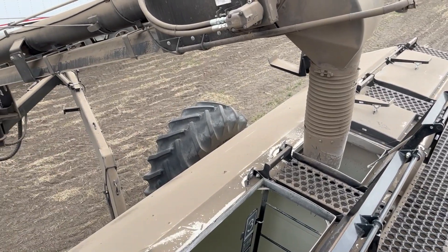There it goes. Sometimes it quits pumping because they're bottom-filled tanks — it takes a lot of pressure to fill the tanks once there gets to be a couple thousand gallons of water in there. So we might have to put another pump closer to the ditch, connect the pumps together along the same hose, and then that pump will push it into the tanks. We're kind of running out of options — not sure what we're going to do come in-crop or desiccating season. We're running out of places to get water.